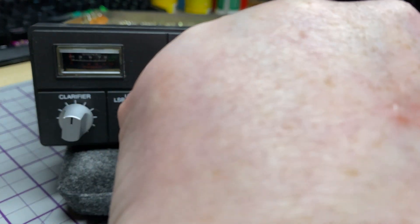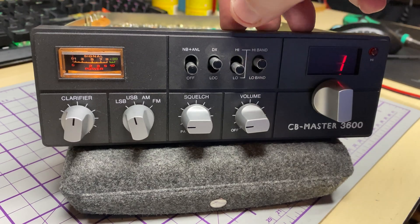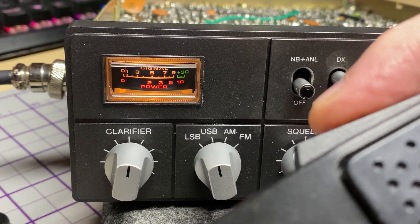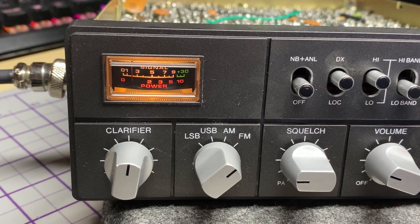So let's have a look at what is actually wrong. The radio switches on - it has low, mid, and high settings. I notice that the 41 to 80 is in the wrong place - I think there's a wiring issue with the switch, but we're going to disable that anyway. Keying the microphone produces nothing - no response from the needle apart from it going backwards. Transmitting from a known good set gives us no receive, so we've got no transmit or receive - absolutely nothing.